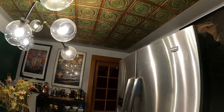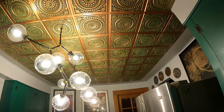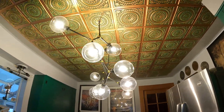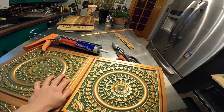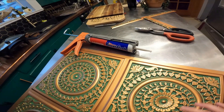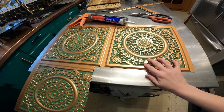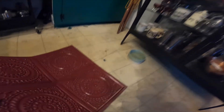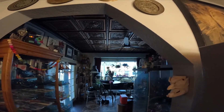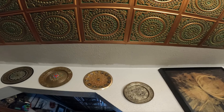I've done the field tiles and that part is fairly easy. The hardest part is you have to do perpendicular lines to make sure everything is lined up. To do a tile ceiling you really just need a few things. I've found that measuring everything directly on the ceiling and finding the fit there is the best way. Also — rooms are not square. I have learned this. You cannot measure from one side to the other and cut all pieces accordingly, because it's never going to fit.